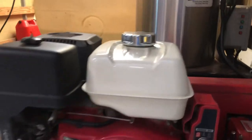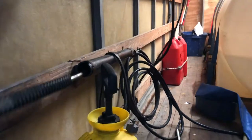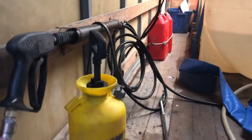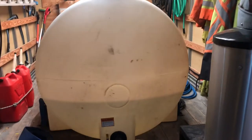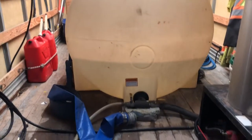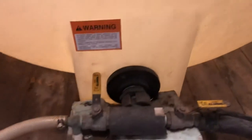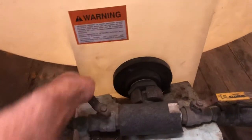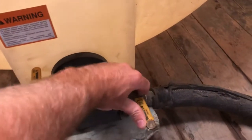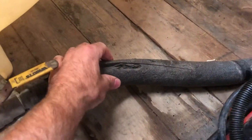There are a few other things: I have a black PVC pipe where I just put the gun in. There are so many different ways of setting these up — I've met a lot of guys with different setups, but this is the way I set mine up. I've got three-quarter-inch ball valves and I can hook up two machines off this tank. I also have it insulated in case my lines freeze up, because I work in Canada and it gets cold, so it just helps out.